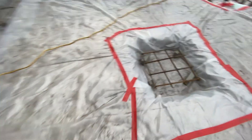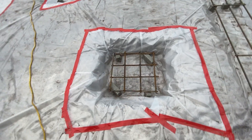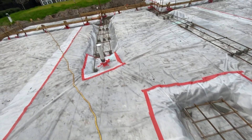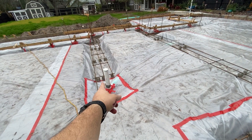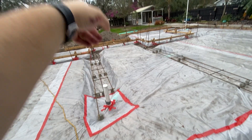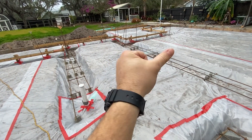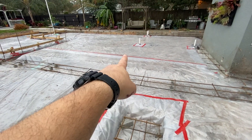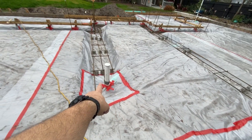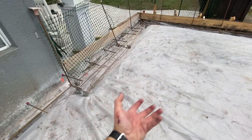That's a sure-fire way to keep everything from moving permanently. This is where a support column is going to be — you can see a nice grid pattern of steel in here. Here's another load bearing wall with the plumbing stub-up for the primary sanitary line, which is going to go up to the second floor and everything will tie into that. Everything is sealed around the stub-ups in plastic and tape — all the red lines are tape seams — to create a good moisture barrier so ground moisture doesn't soak into the slab.